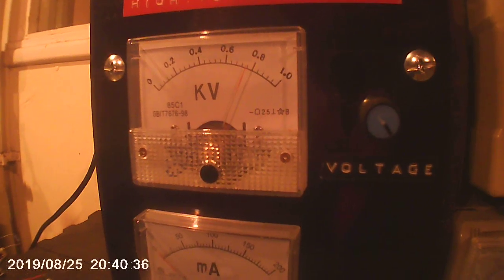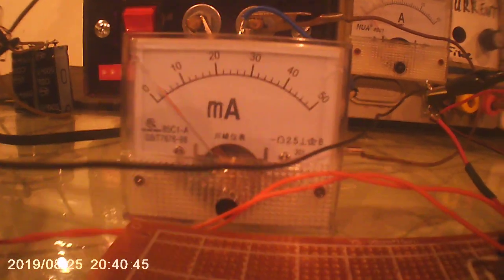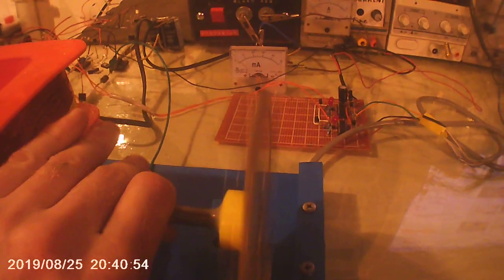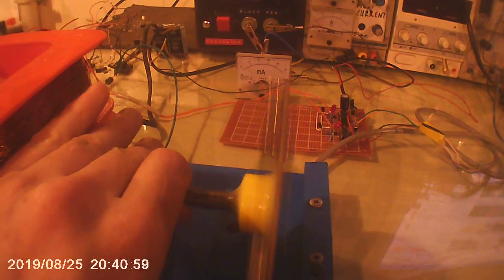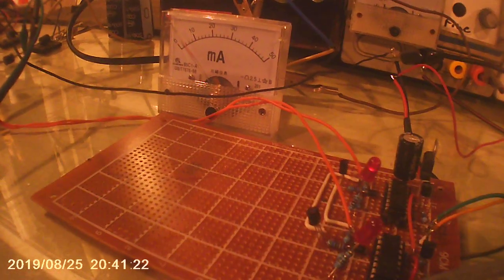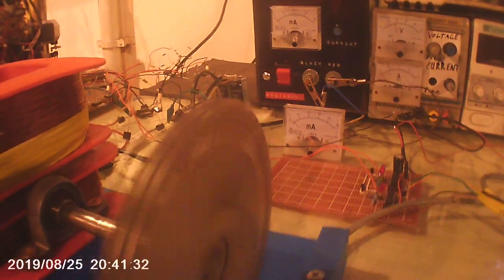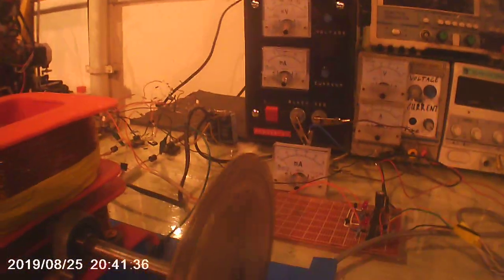Let's hope that remains the case when I up the voltage again. I just gave it a fairly arbitrary twist — that's definitely breaking the record, coming up for 800V now. Current has leveled back down to 3.5mA. I'll be a bit careful doing this. This one's got less torque — if I squeeze it as hard as I can... the current did shoot right up. The old one did that much more efficiently — that went up to 23mA and the voltage would have dropped down quite a bit as well. I'm not sure what the efficiency was but it's of dubiously low efficiency — this is my worst Newman motor yet.